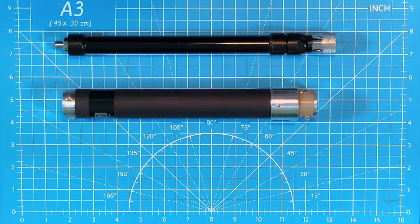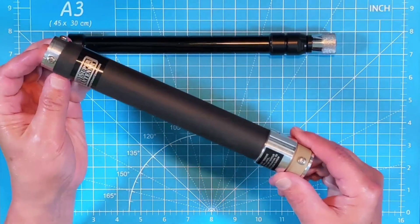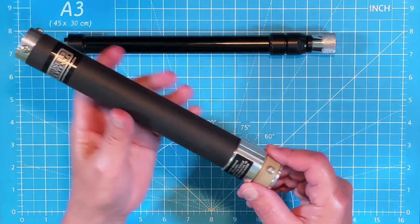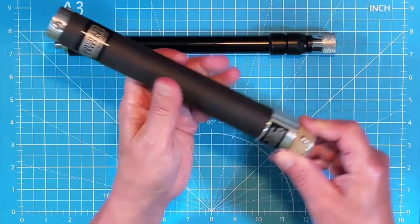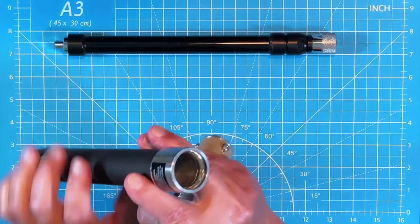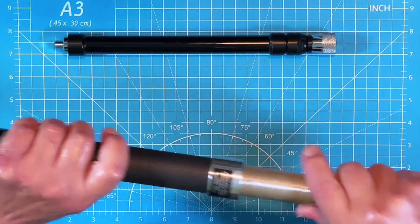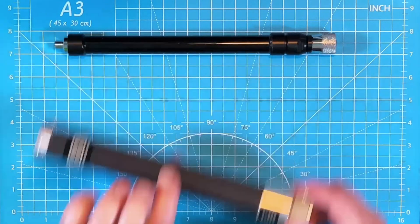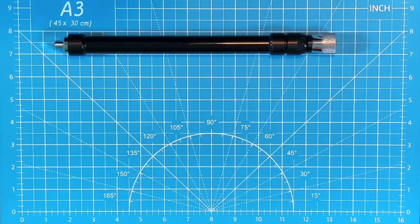There's an alternative — I've owned the Super Antenna; I'll do a review in the future. This Gabriel antenna has a very similar concept to the Wolf River coil Silver Bullet Mini in that it just expands and contracts. I'm doing the same thing with this antenna as I was doing with my Wolf River coil. If you pull this all the way out and look inside, there's a collar that engages the wire depending on how far in you push it, and that is what lengthens or shortens this antenna with this coil.